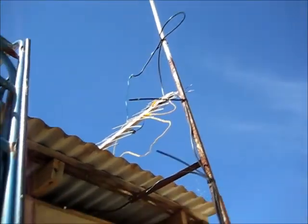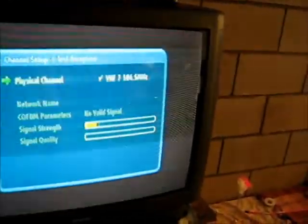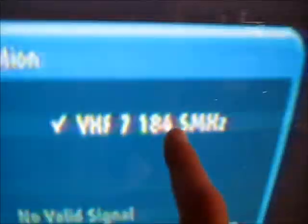I've also got the main antenna hooked up very crudely. The one that was there has been lent out — someone's borrowing it — so I have to put this one out crudely. I really should mount it to the top of the pole and point it to the transmitter, but I haven't got a mount for that antenna with me. Let's do a menu and see if it gets any better. I was getting signal up here before, but I'm not getting very good reception at all. If I lift it up higher I should get somewhere. That's 184.5 MHz — if your channel is VHF, copy that number down and you should be able to find some calibration tool on the internet. There's some maths you've got to work out for that frequency to determine how long your antenna masts have to be.